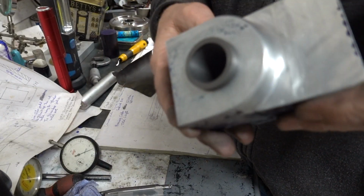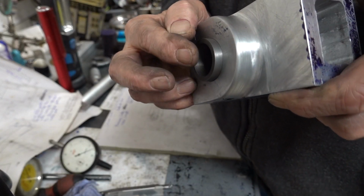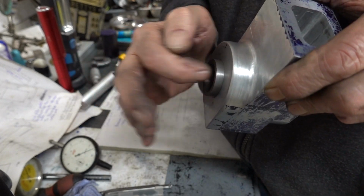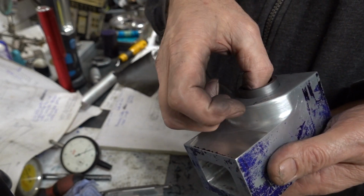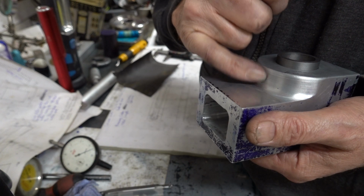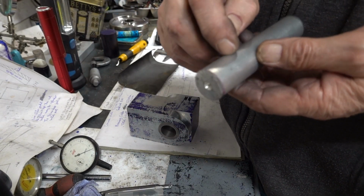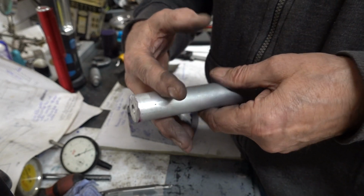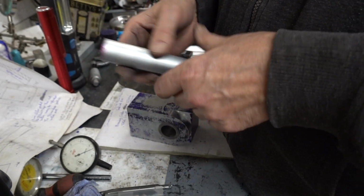So that's the liner sticking out of the back. The piston will come a little bit past that. I'm designing it to do that so you can see it. We'll be drilling a hole down there for the oiler that'll go through the liner and be deburred, so that we can drip oil. And I also plan for the piston to have a hole in it right above the conrod, at right angles to the conrod gudgeon pin, so it'll drip oil on the little end.